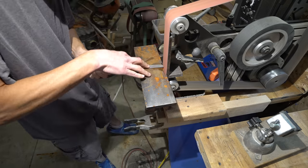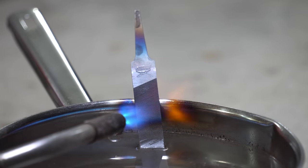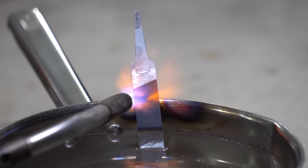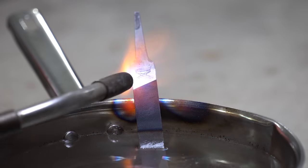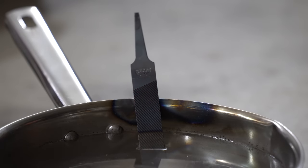This will allow you to drill holes for handle scales and make it significantly easier to grind bevels. Also, if you want to soften just the handle portion so you can drill holes for the handle scales without ruining the hardness of the blade, you can do the old super redneck anneal — put the blade in a pot of water, bring the handle portion up to red hot, and let it cool as slowly as possible. This will allow you to drill holes, but it's not going to be pretty.